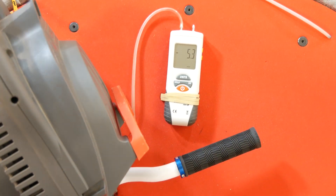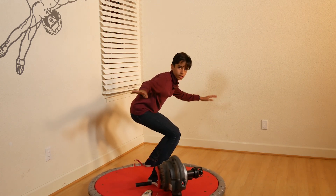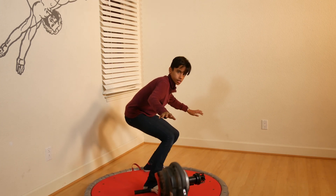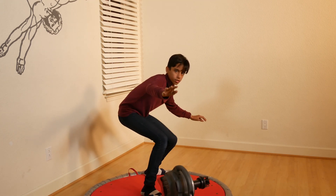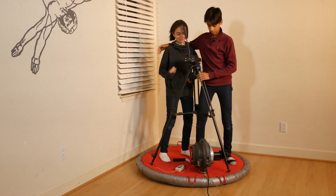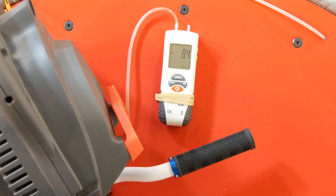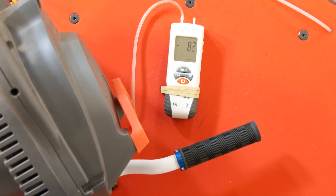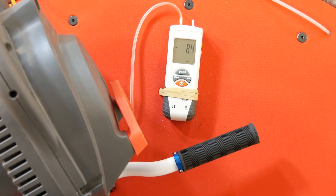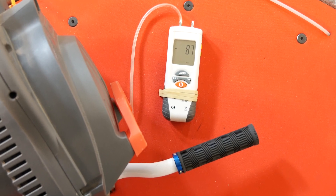When the manometer is mounted, the hovercraft can actually be used as a scale. We found that the pressure under the platform rises proportionally to the weight on it — which makes perfect sense, because the air pressure has to lift the platform high enough to escape below the skirt, and if the weight is twice as heavy the air has to push twice as hard. You can estimate the pressure by dividing the weight of the hovercraft and its load by the surface area under the platform. With Gia and me on it, the hovercraft weighs 100 kg and has an effective surface diameter of 120 cm. A circle with a 120 cm diameter has a surface area of about 11,310 cm², so 1 cm² has to lift about 8.8 g, which equals 8.8 millibar. When we arranged ourselves on the running hovercraft, the actual measurement was 8.7 to 8.8 millibar — our calculation was spot on.